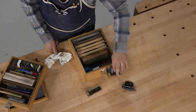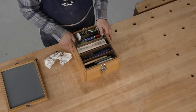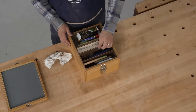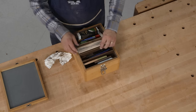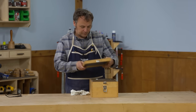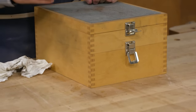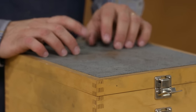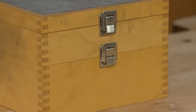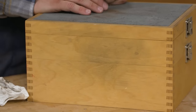It's a really spacious box that holds quite a bit of sharpening gear, and it doesn't have to be this particular set. Every woodworker is a little different, so your equipment will vary, but with the removable dividers you can mix and match the compartments to whatever you want. If you want to make one yourself, it's made from half-inch Baltic birch plywood joined with box joints, giving it a fun graphic look as well as being super strong. The plans are at woodsmithplans.com so you can make one and keep your edge tools honed and ready to go.